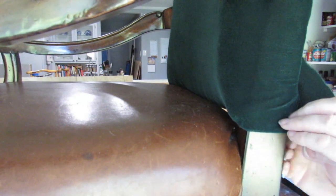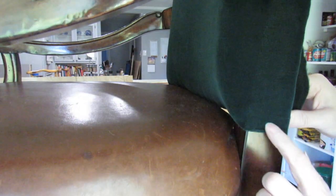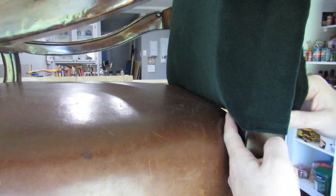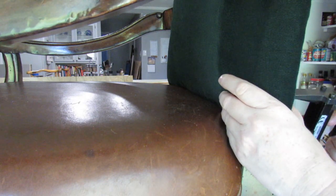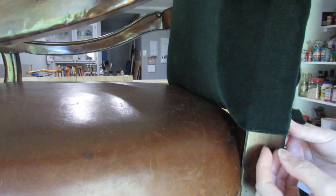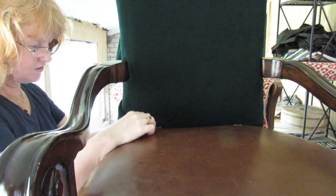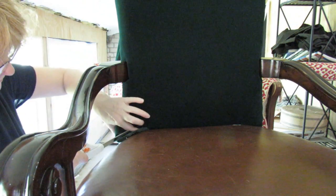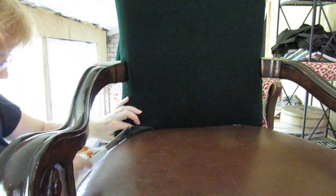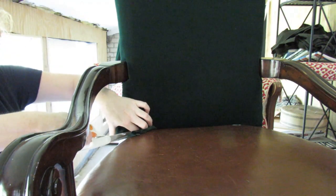It's always handy to have something like that you can use. Then I'm just going to pull it down and round, hopefully get most of that pleating out. If there's a little bit here don't worry. As I say, it's dress weight so it's not going to be as thick as normal upholstery weight. Secure it so it's flat along the bottom, then repeat on the other side. Pull that out as far as I can, find the upright. I'm going to cut from here into where my finger is — basically there. Pull that down as hard as I can — aim blindly but with confidence.